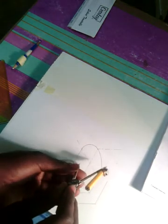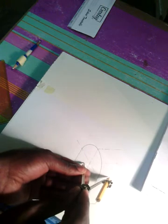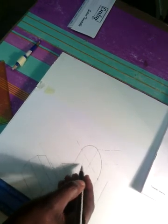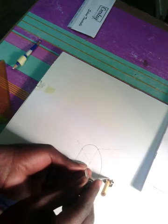How did you draw this arc? Where were you placing your compass when you drew this arc? Which means you have to take this corner — faint, like this — from here till there. Now you come and record: the time I drew this arc, my compass was here. So now, without shifting your compass, you'll be placing it along this line, but your pencil lead has to start to draw from there — from here till there. You can also measure 20 millimeters from here to get an exact point along this line.